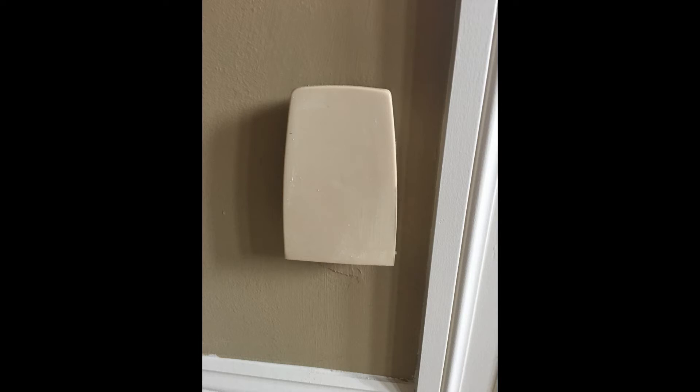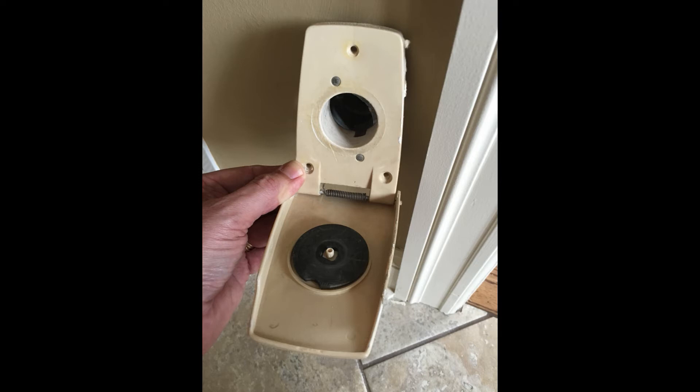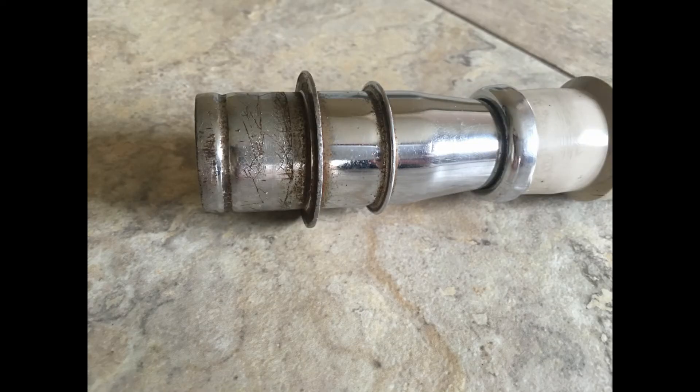Here's a little later style from the 70s — a plastic version of the same thing, same shape, installed the same way. But the activation is actually slightly different on these plastic ones. Instead of a little switch, you just have two tabs in the neck of the inlet, 180 degrees apart, and the metal of the hose end completes the circuit, which is kind of similar to a modern system. But the inlet opening is just ever so slightly different. This is the old hose end — it is slightly smaller in diameter, and that flange about an inch back from the end is necessary to press on the button and activate the system when you have the metal inlets. This is not available anymore, so we have to update these.